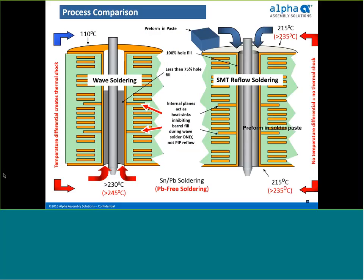To better understand the advantages of surface mount over wave soldering, let's examine what's going on during the soldering process of through-hole components. In wave soldering, the flux, pin, and plated through holes all help carry molten solder up the barrel as it travels over the wave. However, there always exists a temperature gradient from the top side to the bottom side of the board. Since solder prefers higher heat, it's reluctant to flow up the barrel. Additionally, internal copper layers or ground planes act to pull heat from the barrel. These factors often result in underfill barrels, especially in thicker multi-layer boards.